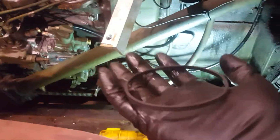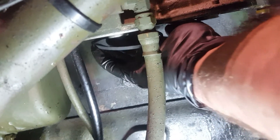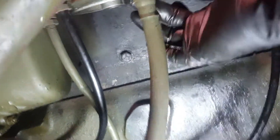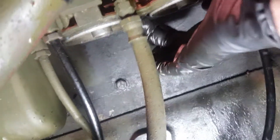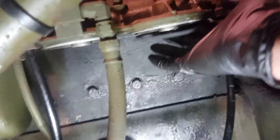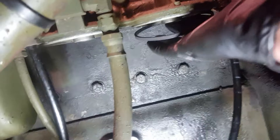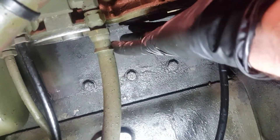Now you're done with your pick, put that back in your toolbox. You've got brand new o-rings — these are just the standard o-rings that come with factory-type replacements. Work it up in the groove all the way around and it should keep itself in the groove. Don't let it twist. Then install the second o-ring the same way, finding the back of the groove and slowly working it around on both sides.